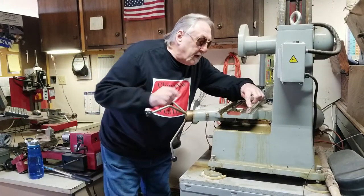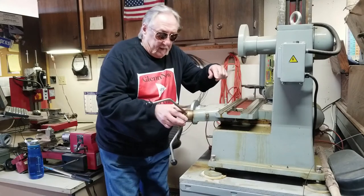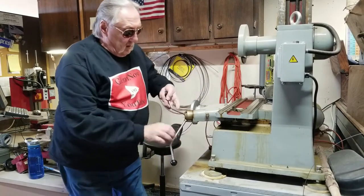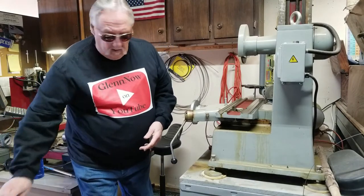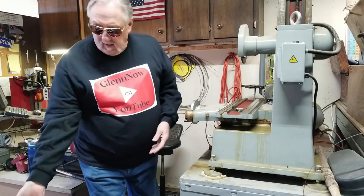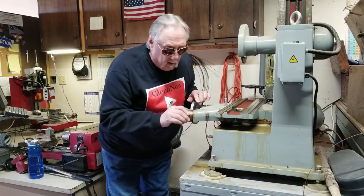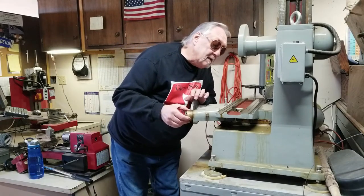Get a measurement from here to here. I'm going to have to find the high point — put a pin in there to find the high point. This keeps rolling so I need to stop that. I think I'm going to replace that with a round handle; I don't like these things. The table goes up against there with no gap on one side, and there's about a 30 to 40 thousandths gap on the other side. It looks like it's got a solid pinion in there, so it's not like it can be adjusted easily. I'll have to put some shims in there, I guess.